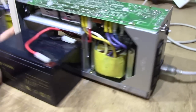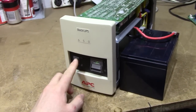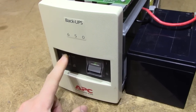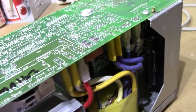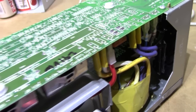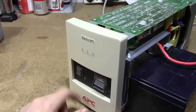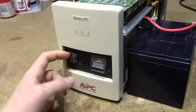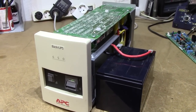On the larger 500 and 650VA models you do get a self-test button, which is very simple indeed — it just runs the self-test as long as you press the button. You could probably drain your entire battery by just holding the button down. There's basically no hysteresis on it. Something you do get that you don't always get is an alarm silencing button, if you don't have the alarm disabled by the dip switch on the back. I don't think that disables the low battery alarm though, so I believe these will always beep on low battery unless you desolder the speaker.